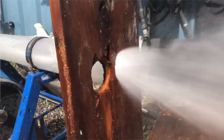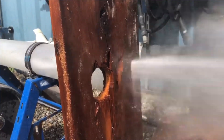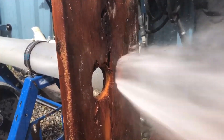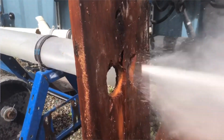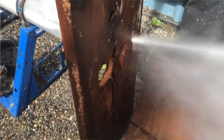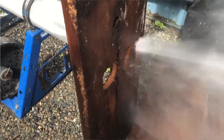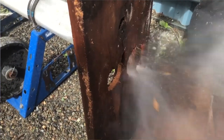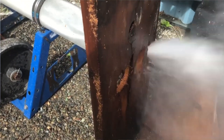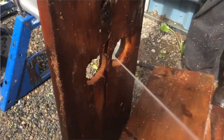These are wonderful, especially when you've got to work downstream. In hydrojetting, we love to jet upstream so we can pull whatever we're jetting back in the direction it naturally wants to flow — toward a catch basin, interceptor, manhole, or just toward the city sewer. But so often we've got to jet downstream, and when you have that forward rotating cutting cone, it can really attack a root mass right up front.